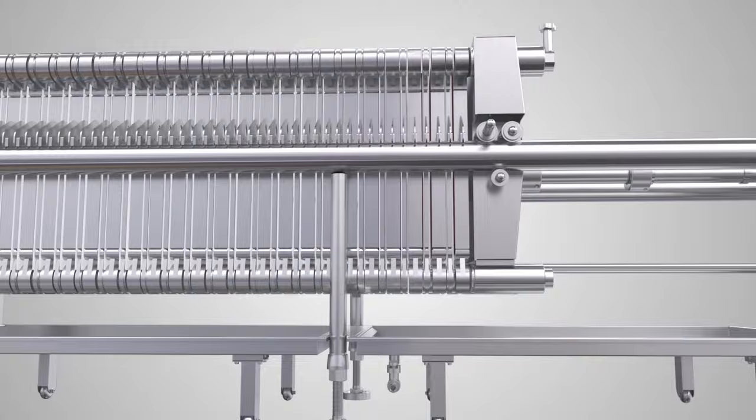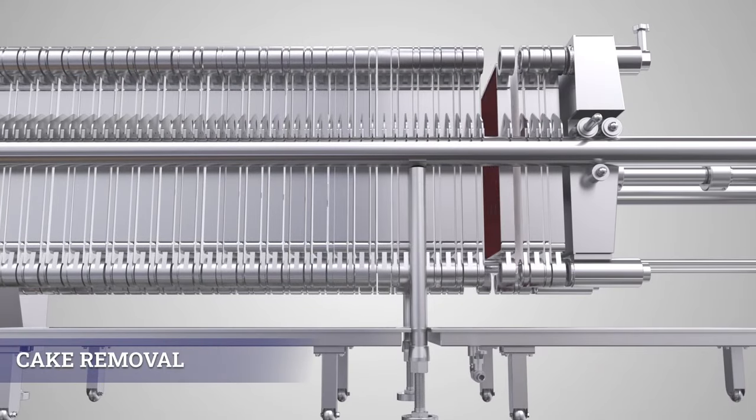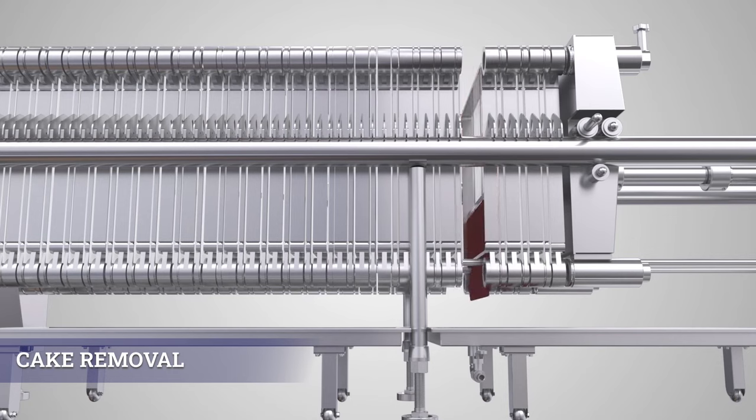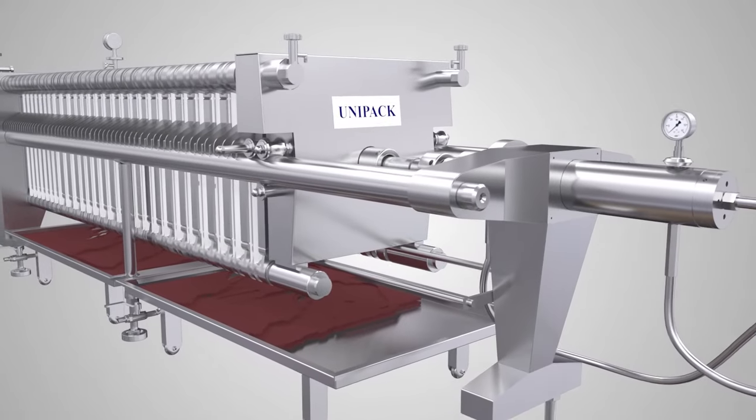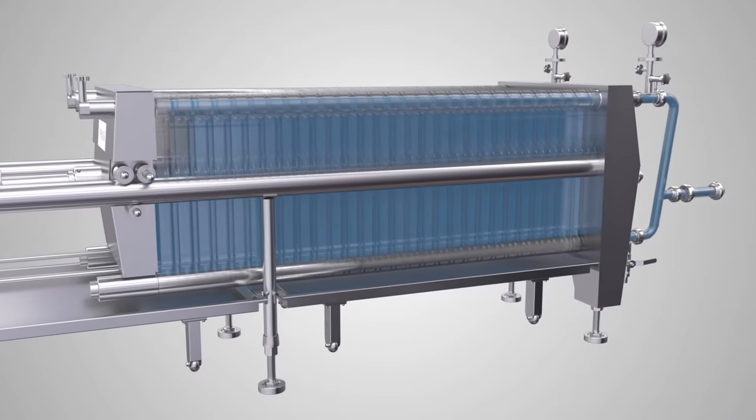The hydraulic device is retracted, whereby the cake falls in the drip tray, after which the filter papers are either replaced or used again for the next batch. The unit can be used with a bypass plate to achieve different micron grades of filtration within the same unit.